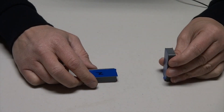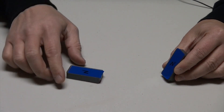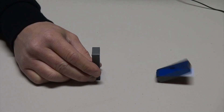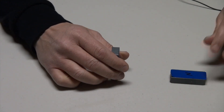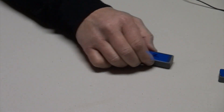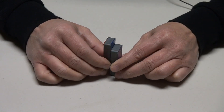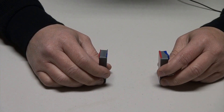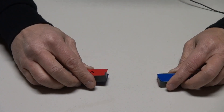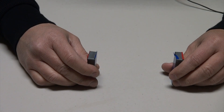The second concept is that two like poles will repel each other. With a north and a north, when you put them close together, they push each other apart. Opposite poles will attract each other. This is important in the function of the electric motor because the rotor will produce north and south magnetic poles as we run current through it. It is the interaction between the magnetic fields of the stator assembly and the rotor that generates the rotation.